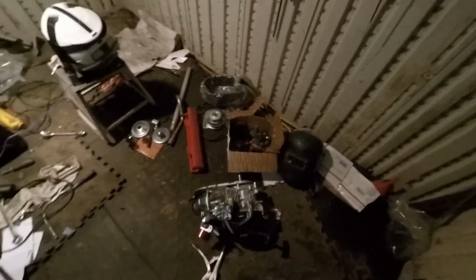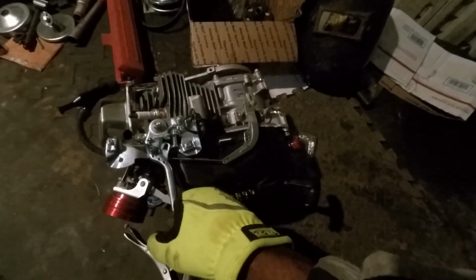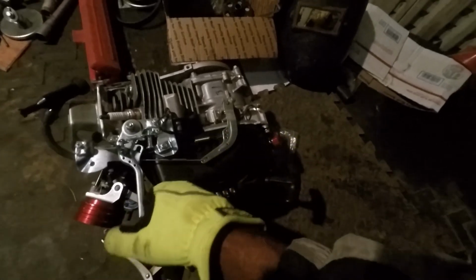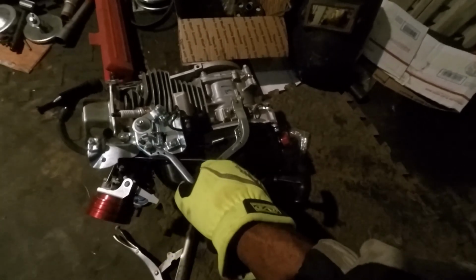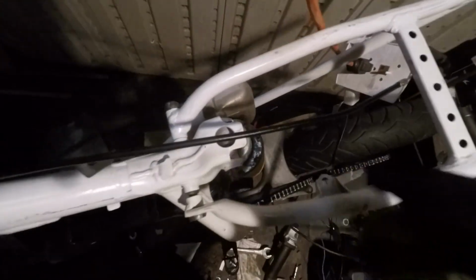The only problem is I gotta ask 80's Moto about where he put his linkage here. I'm gonna put a return spring on there so it pulls back, because it's real stiff and it's just not flowing back at all. I'm gonna grind all these pipes down, and then we'll get ready to bolt the motor down and get the rear brakes set up. I got the rear brake caliper on there. I just gotta run the line and get some brake fluid so we can run the pedal.